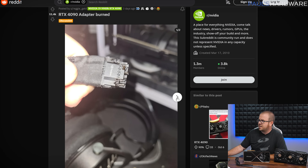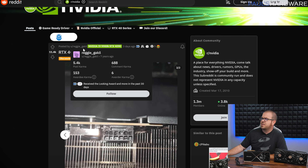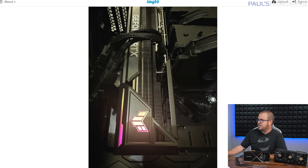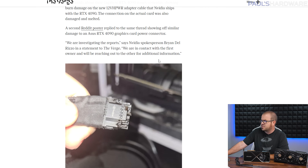The first question for a lot of people who saw this image posted about three or four days ago is: is this a one-off issue or is it widespread? Unfortunately, it quickly became apparent that Reggie Gekiel was not the only one to experience this, as multiple other users have chimed in showing pictures of melted or burnt power connectors. And they aren't necessarily using these cables in a horrible fashion — they're either vertically posted or in cards mounted vertically, without an adapter cable scrunched against the side panel or anything that might cause trauma to the connection. NVIDIA does appear to be paying attention to the situation.